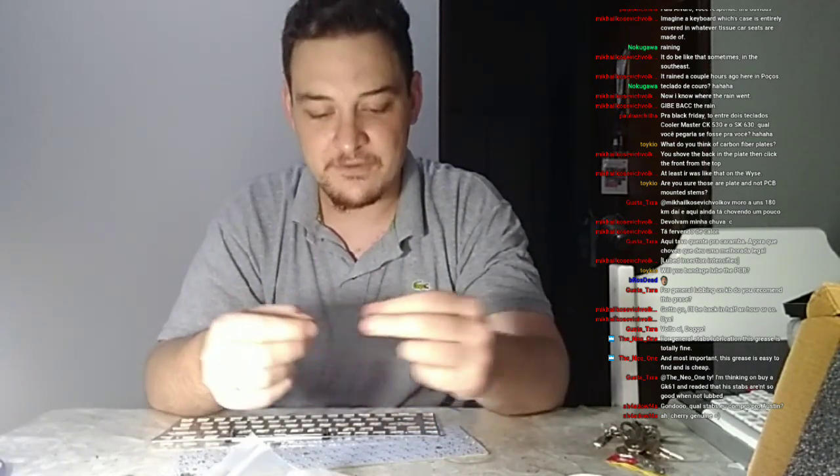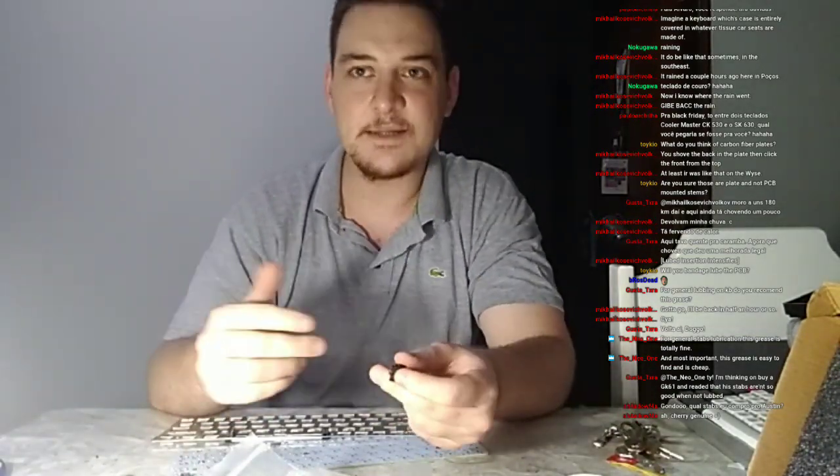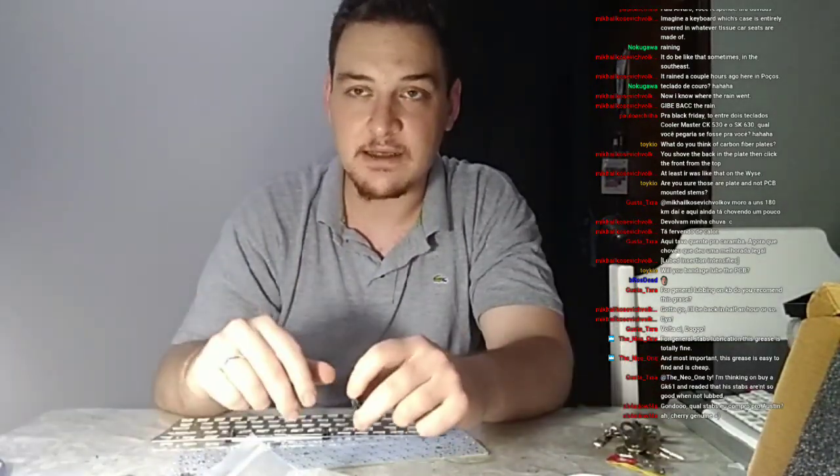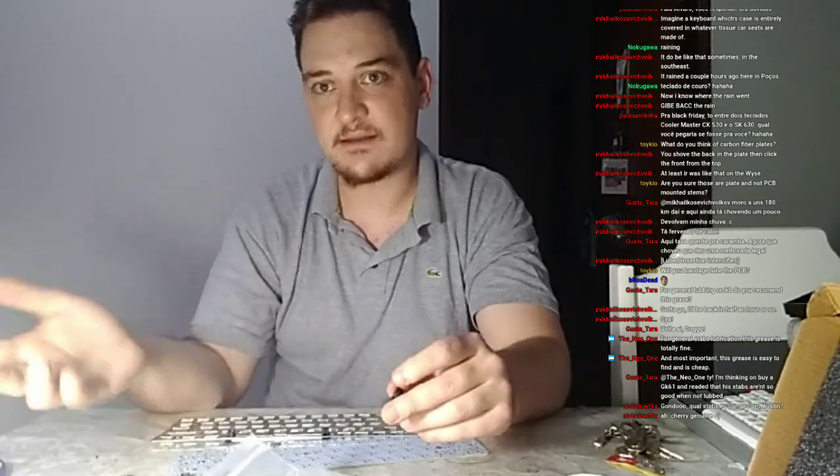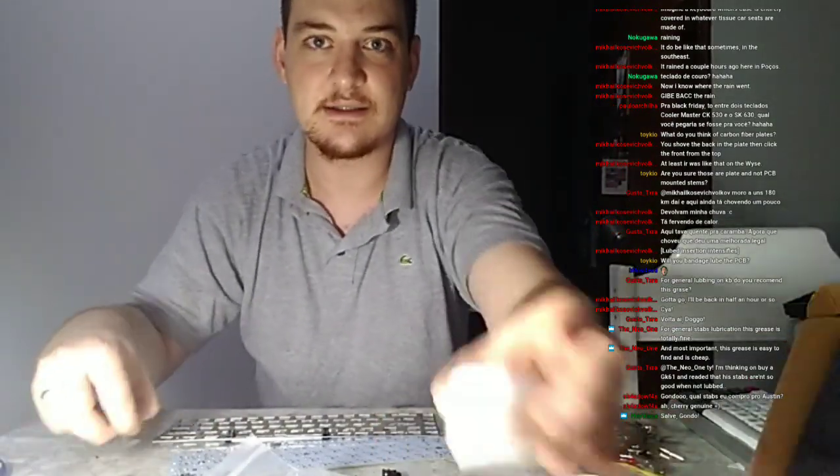Gando, which stabs do I buy for Austin? You gotta go for the big stuff, man. ZL stabs, Austin is a very high-end keyboard. So ZL stabs, I heard that the Everglide ones are awesome too. The Durock ones I haven't tested, but they really look like the Everglide ones, so they should be good too. I have a set of ZL stabs here, amazing. I have also a set of EPBT stabs here, awesome. Genuine Cherry stabs, can't go wrong with these, at least avoid the later batches. Yeah, but you can also get the ZL stabs, which are the premium, nice quality stabs.